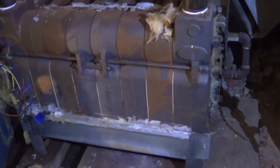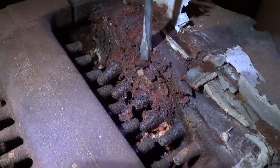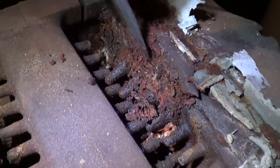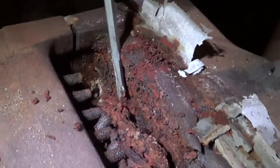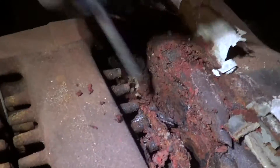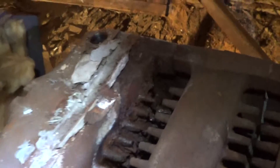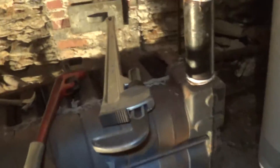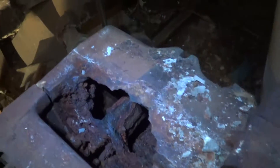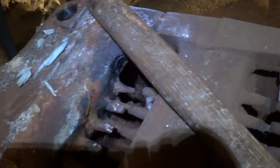You got the boiler broke down. And here's where the two leaks in the heat exchanger are. So the cast iron — you got a pinhole leak and then the steam to finish it off. And there's not much left there. You can see all that just popping right off. This side was just starting to leak very small. This side had the bigger leak right here. You can see right there — that was where the oxygen corrosion was taking place. Same thing on that side there.